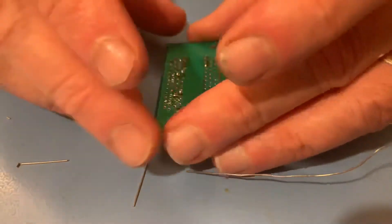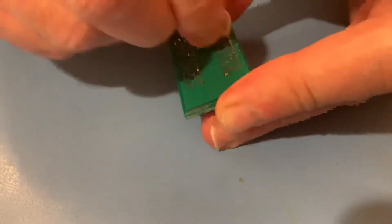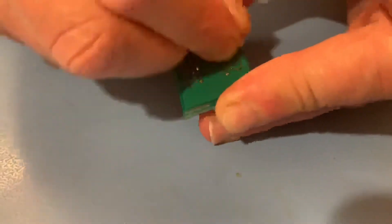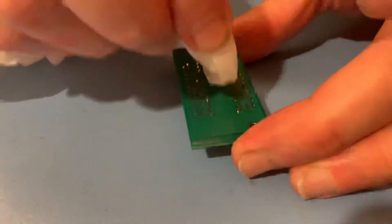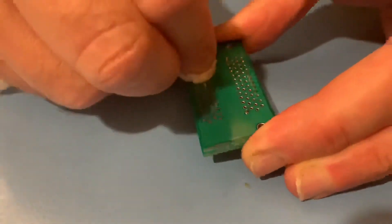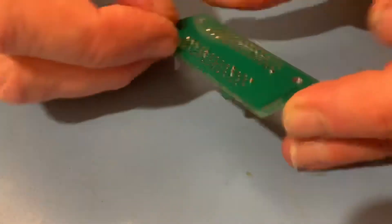On this board every joint is the same height because the height cutters predetermine it. Now just so you get a better view of the joints, I get a little bit of cleaning fluid and lightly go over the joints to give them a little buff up. The flux I use is non-corrosive so it's not really a problem if I leave it on, but it just makes it so much easier to see the joints and gives a nicer finish. Clean that off nicely — this stuff evaporates on its own. There are various different cleaning fluids you can use but they'll do the same sort of job.